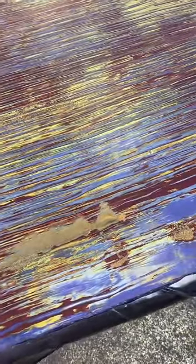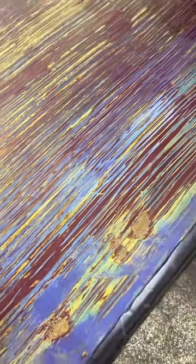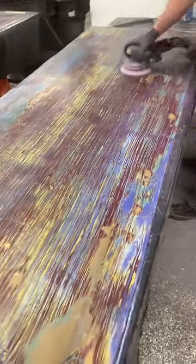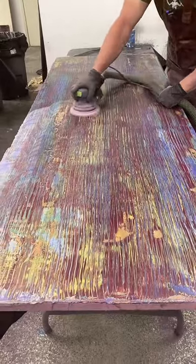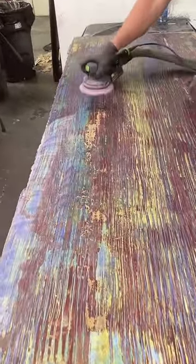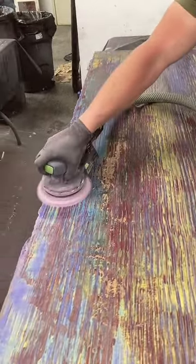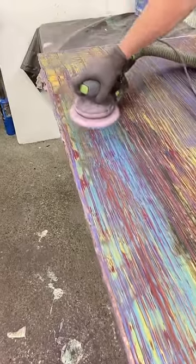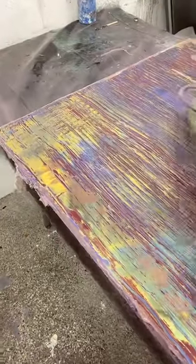And remember, we talked about the foam-backed pad. That's why the next one's foam-backed. And that's with all the pads, once you go to foam, it's going to sand and polish much smoother. But you really want to do all your profiling cutting with something without foam on the back, because you want it really rigid until you're trying to polish, because a rigid pad will cut your high spots off and it'll avoid sanding more out of your lows. Whereas if you have too flexible of a pad, if you have a low spot, it still dips down and sands it more, and the high spot, it'll go over it and not really cut it off. So I try to keep a really rigid pad, a lot more rigid disc with no foaming or backing or anything on all my coarse grits, and then I'll go to more foam once I get past like 2000 or something, because all the highs should be cut off by now if you did your job. If you had to step back down, it'd be because you missed something.